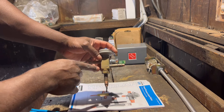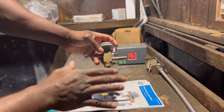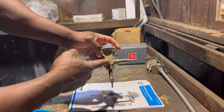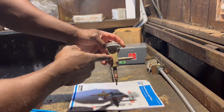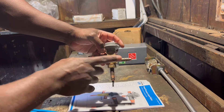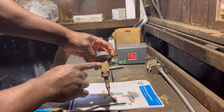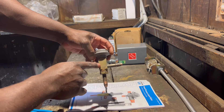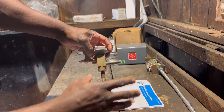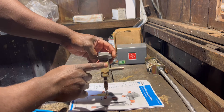These are more common in refrigeration. You go straight to your receiver. On a normal day, this valve would just operate like it's not even there — it'll just go straight through the compressor, condenser, and back out to your receiver. Now on colder days, you have to maintain a proper head pressure, because if not your system would not operate properly. There will not be enough pressure to get that liquid to the expansion valve. So this is to maintain your head pressure.